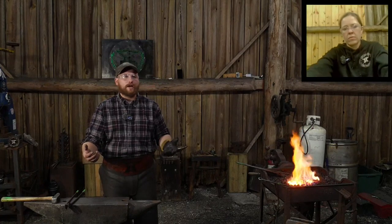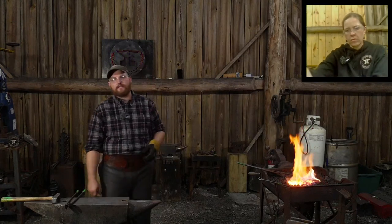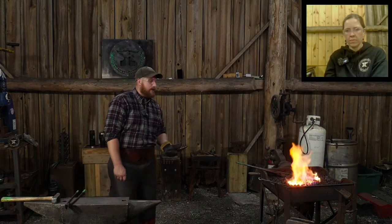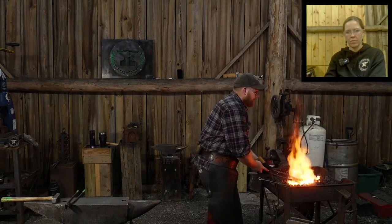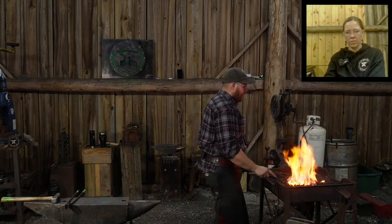So this whole thing I could probably do myself. If you've heard me a couple times, I've told Thomas, whoa, just lighter, right? Because you don't have to murder the thing. You don't have to swing for the fences as you would on 5/8 inch thick mild steel by 1.5 inch wide, even with a sledgehammer. But with wrought, it makes you feel like, oh yeah, I'm a tough guy. Look at this, I'm moving some material. Take a 2-inch round bar of wrought iron and a 2-inch round bar of mild steel, and there's a huge difference. You can forge out that 2-inch wrought bar by yourself with a hand hammer. With mild steel, not happening, or you're gonna be very sore after you resize a chunk like that.